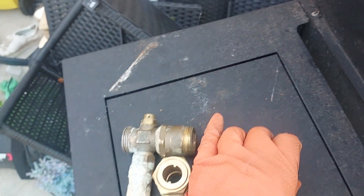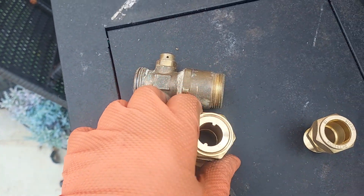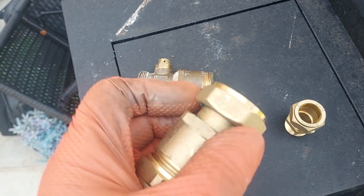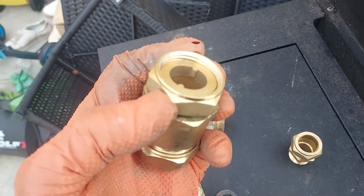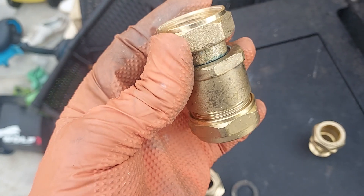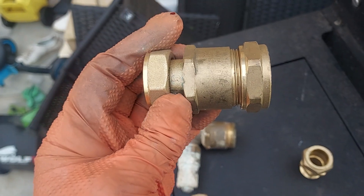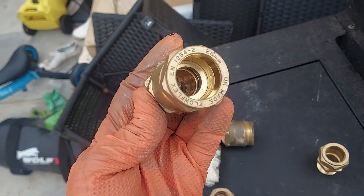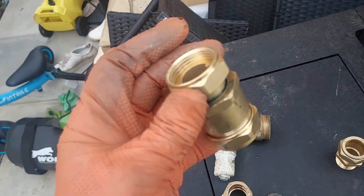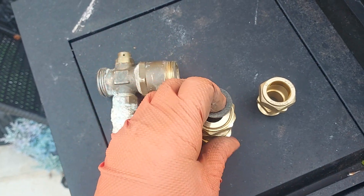But if it's got a parallel front like this one, it's not going to tighten up. So for this we need to use a flat-faced union. Here we have a flat-faced union — this is inch, it's got a three-quarter male taper thread that's been inserted with Rapid Blue into a three-quarter to 28 mil female line, and that's ready to rock and roll. We have a nice little rubber washer that pops in there.